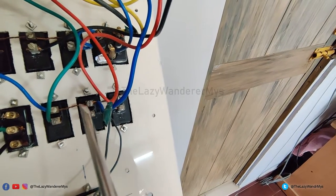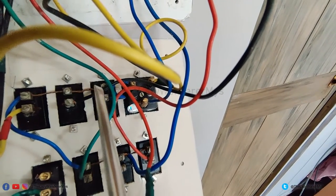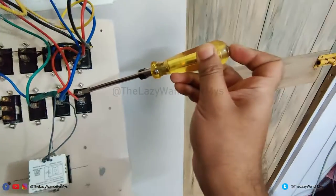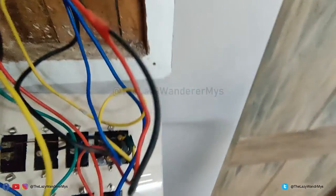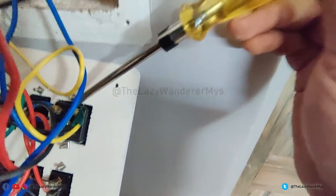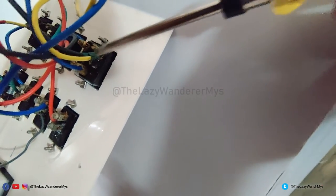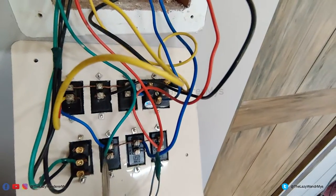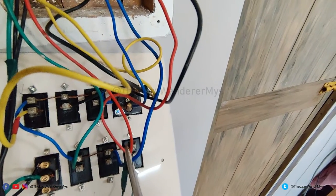The common open copper wire you see is the line or phase wire — as you can see, it always carries current. The neutral wire is usually connected to the socket. The wire other than the phase wire on your switch is the load wire that connects to the devices. In my case they are green and red wires; it may be different on your switchboard, so check before you proceed.